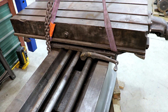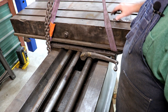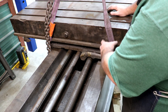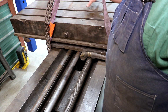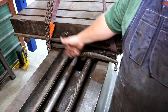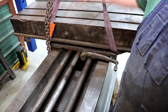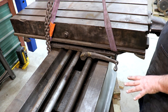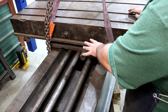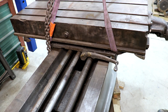Looking at these three screws I was describing: one of them is threaded — that's the one that powers the table back and forth. There's a bronze nut back here and it's already pretty much off that nut, so it's not connected. These two rods have a block mounted underneath that they both slide through. There are keyways in them, and they're just turning a shaft that enables you to power something else. I think one feeds the cross feed and the other goes to the tailstock that raises it up and down. Right now, I need to slide everything off the back while I've got it suspended — but these rods are still up underneath the bottom, so I need to move it back.